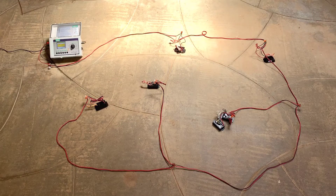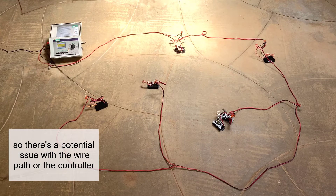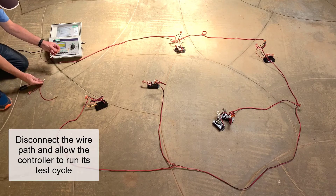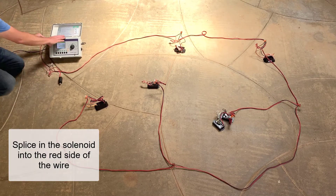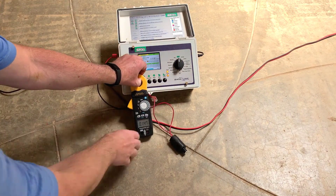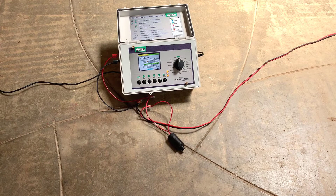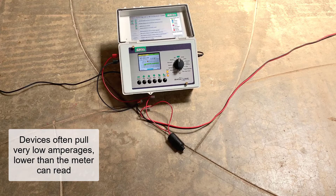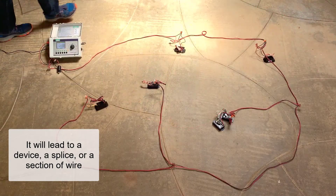I've transitioned outside to my wire path mock-up. There are only six devices connected to my small training controller and the wire doesn't meet specifications, but you get the idea of what we're trying to do. The controller is already in an overcurrent state, meaning there's a potential issue either on the wire path or in the controller. I'll disconnect the two-wire path and give the controller time to complete its test cycle. While waiting, I'll connect the solenoid to the red side of the two-wire path. With the wire path and solenoid connected back to the controller, I'll use my milliamp clamp around the red wire closest to the controller and get a benchmark reading — 147 milliamps. The actual number isn't important; it differs from the office reading. Generally, devices pull very low amperages, sometimes so small the meter can't read them. We're going to be chasing a big amperage draw down the wire path. Follow that big number and you can find the culprit — whether it's a device, a splice, or a section of wire.